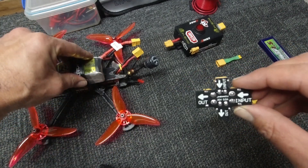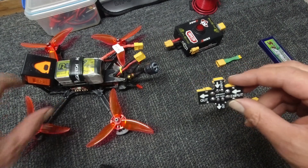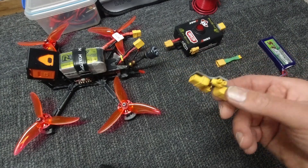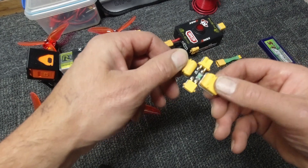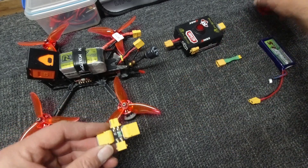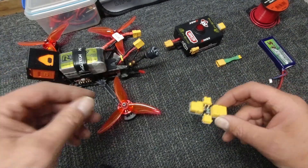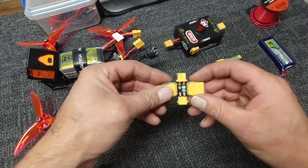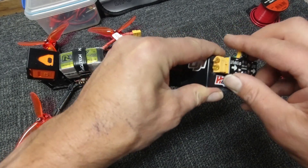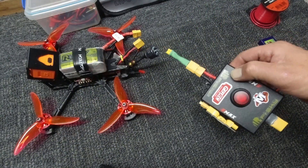Look, this isn't a failsafe — things can still go wrong once you connect this up, you can still have shorts. But this is certainly a step in the right direction if you want to do the most you can without poking and prodding with your multimeter. There are other smoke stoppers on the market — you can grab yourself some wire, a soldering gun, and a light globe and hook up a contraption that does the same thing. Or you can get something small like this that I'll just carry around in my kit easily when I'm out in the field.